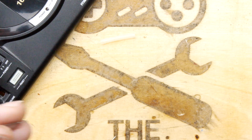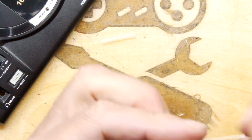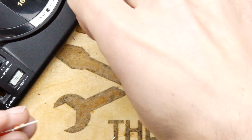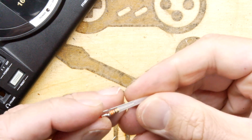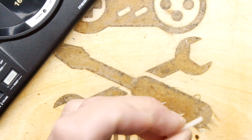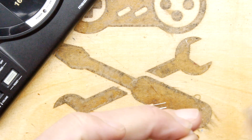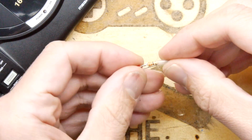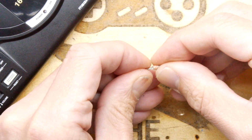Again, it will depend slightly on our input source, because Raspberry Pi's got a 3v3 rail, of course, and 5V input from the USB. So I've kind of made an assumption there that we'll be using 5 volts, but that might not be available. That's no problem though, really. We'll just change the resistor out. So I'm going to put a bit of heat shrink over there just to make it pretty.